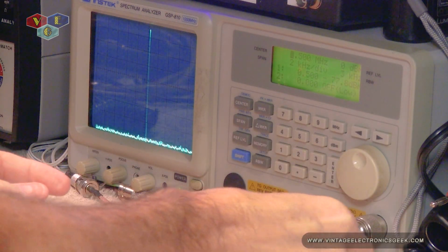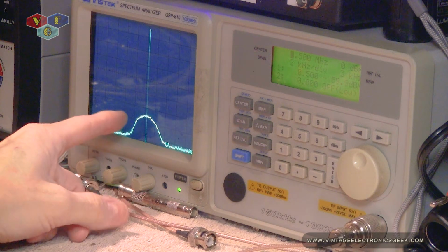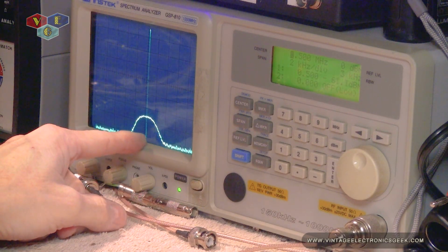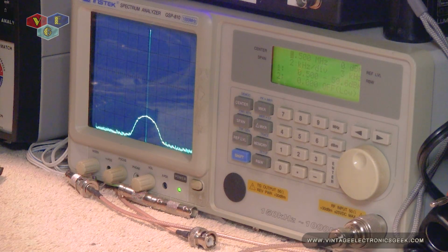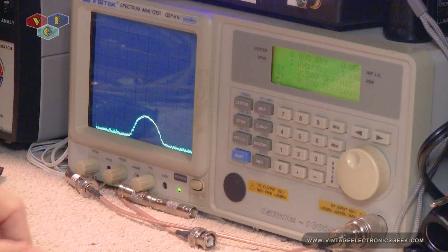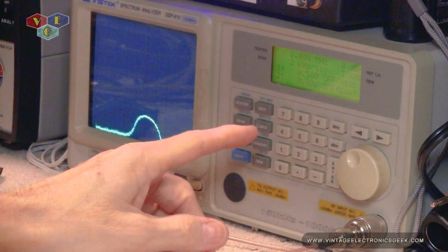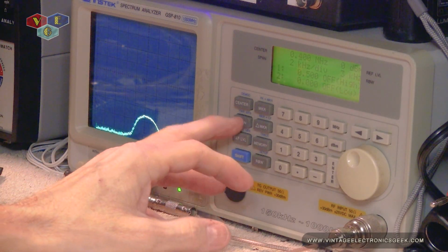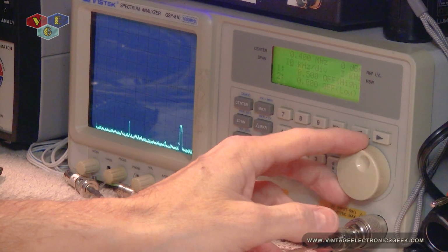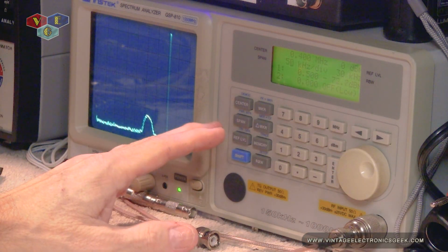So now what I'm going to do is take the signal generator. We're going to leave the device here set at 0 dB for our floor. And we're going to drive this down until it's flat, or we can barely see it, or something like that. So right now we're at 500 kilohertz. And to save time, especially editing, let me just push buttons and holler out. So there's 400. Now this is going to be really challenging because I have to wigwag like this. My device here unfortunately does not have a really wide spectrum. Well, let's see here. All right, so 50 kilohertz is my maximum bandwidth.